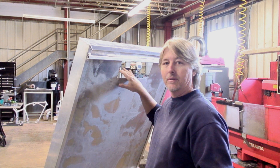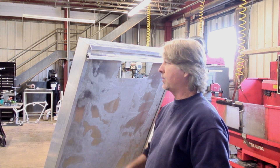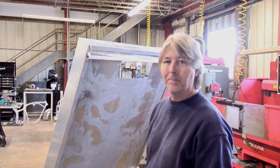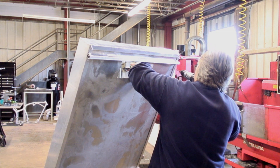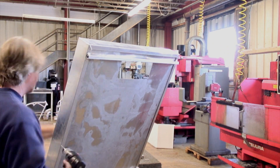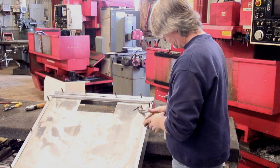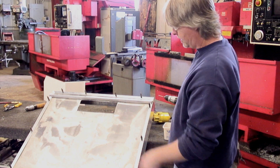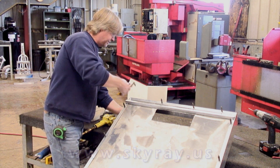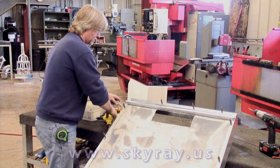As you can see, we now have the holes cut for our duct work to go in. We're going to go ahead and pop rivet this piece into place, then throw our insulation in and hopefully button it up. That pretty much finishes up the drilling for the rivets — that's all our CLECOs — and now we can start putting the rivets in. All we have to do is start pulling our CLECOs out and installing our rivets. Just like that — let's do it.